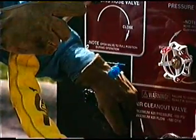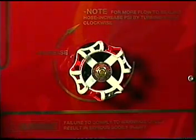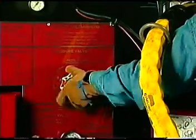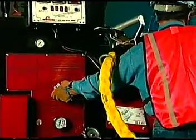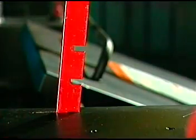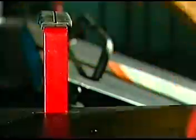With the wand in the access port, open the sealing hose valve. Turn the red and white pressure valve clockwise until the pump starts to slow. Observe the material flowing from the wand end, either through the access port or from the loading door. Adjust the pressure valve to achieve the sealant flow rate that you want. Now that the pump is up to temperature, you can close the damper to the heating cabinet.